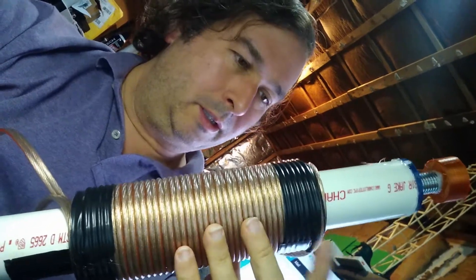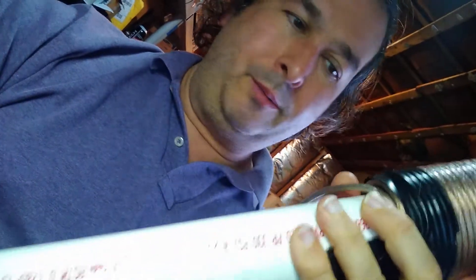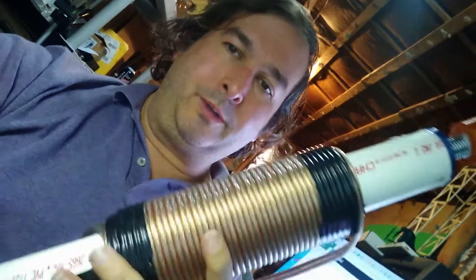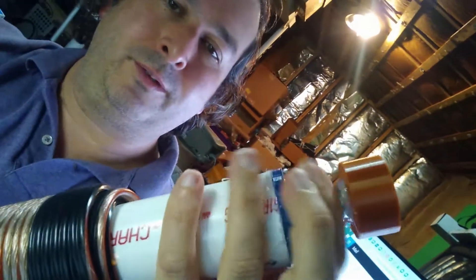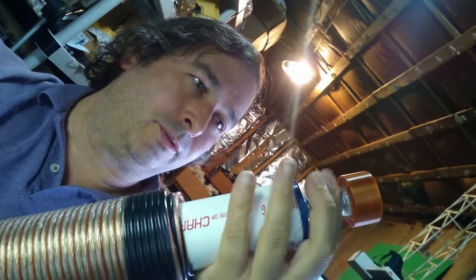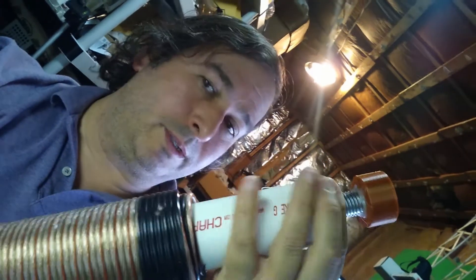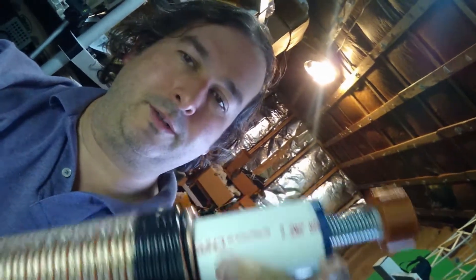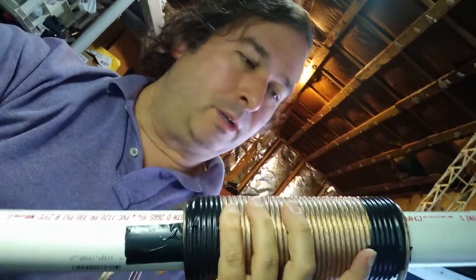If I put it down here, it'll be replacing air core with a big inductor, so it should have much better performance — basically a bigger swing between the lowest inductance and the highest inductance. I don't know what kind of loss this is, but typically the ferrite cores have very low loss at RF frequencies. These iron cores are not guaranteed to have low loss because they are conductive — much more conductive than the ferrite cores. Ferrite cores are made to be nonconductive, so they have very little ohmic loss.